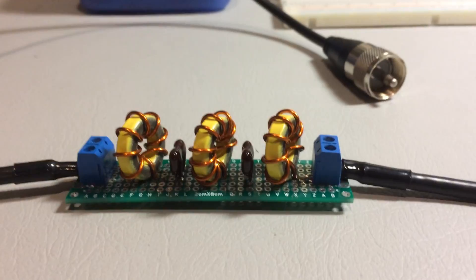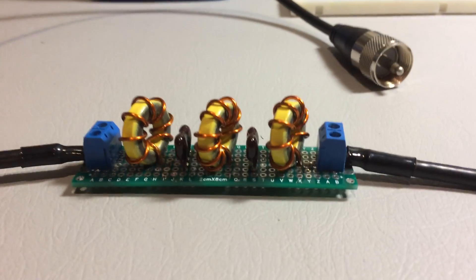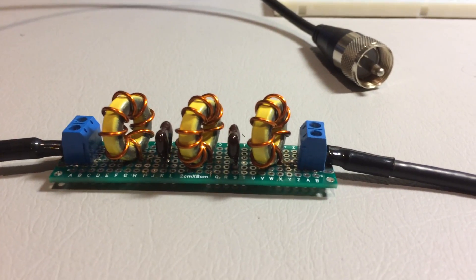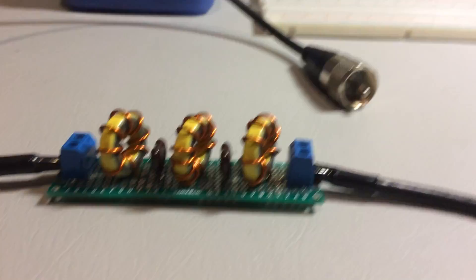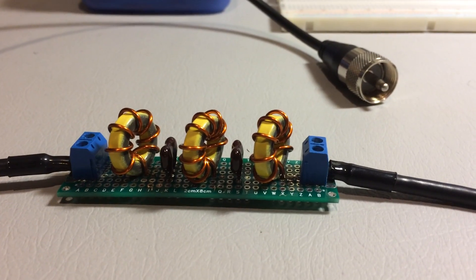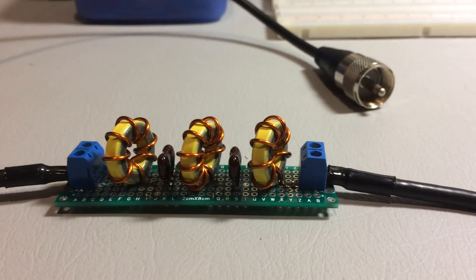So there's basically the finished circuit. Remember, this is a fifth-order filter, so we have five poles or five components — an inductor on the input, an inductor on the output. And as a reminder, this was designed for the 10, 11, and 12 meter bands, which are all grouped together.